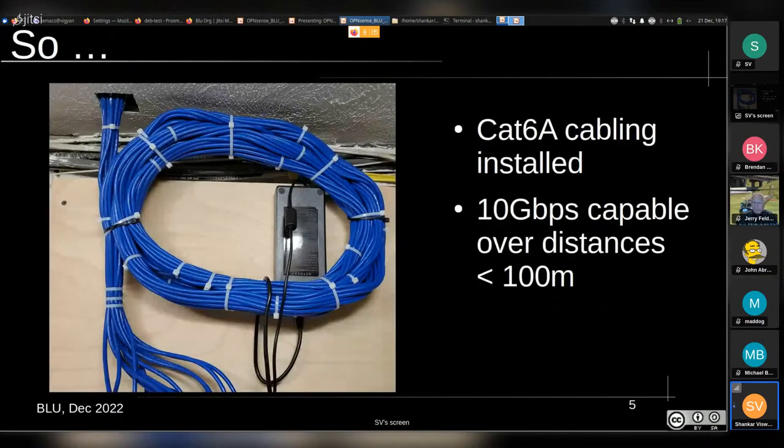Along with a bunch of other people, we all did some home remodeling during this pandemic. We redid bathrooms in our house, and I took advantage of that to have the contractor put down some conduit and then lay out Cat 6A cabling. This can do up to 10 gigabits, over distances less than 100 meters. So I had these wires installed,